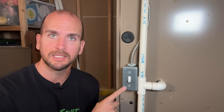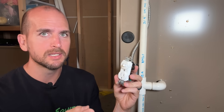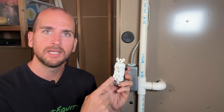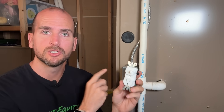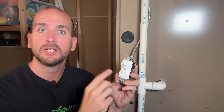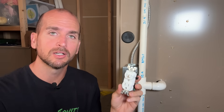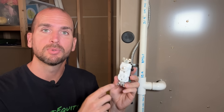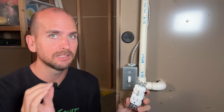Now for the combination power disconnect switch with an outlet at the handy box. This does meet code even though code says the circuit must be dedicated — which sounds confusing. In this configuration the light switch not only provides an on/off disconnect for the furnace but also turns the outlet on and off. This outlet is most commonly used for a condensation pump or auxiliary equipment tied to the system, which is allowed by code.